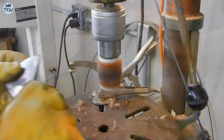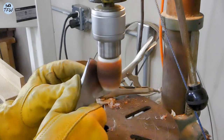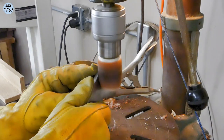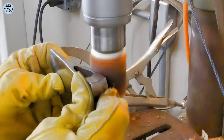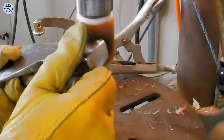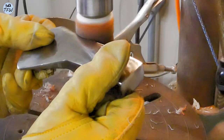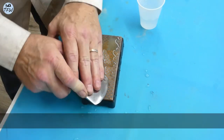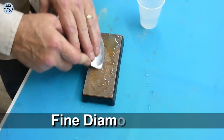I didn't have a polishing wheel for my benchtop grinder, but this drill press attachment seemed to work out pretty well. While the original axe initially came painted, I liked the polished finish on this one. Though the 1000 grit belt did a nice job on the bit, my diamond stone finished the edge pretty nicely.